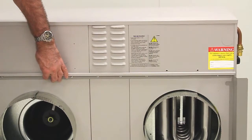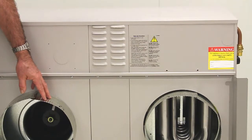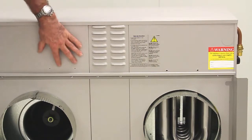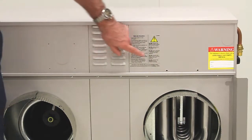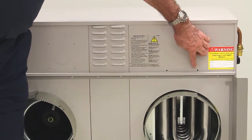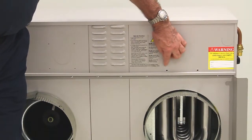The reason why we're fitting flashings on the back of this external machine is to protect the ducting from the elements. Now as this is sitting outside, the rainwater is going to run off the top of the lid and run down the back of the machine, so we don't want that water going behind the rail and onto the ducting. And while we're here with the sealant, we've got the 2 screw holes here where the handle was, where we've relocated this panel, so the dab of silicone over those points won't go amiss.